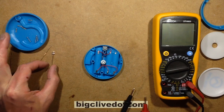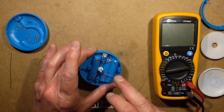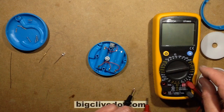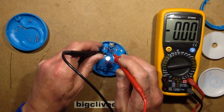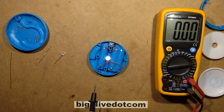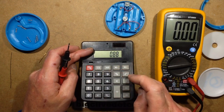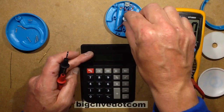I've looked at a suitable replacement resistor and LED. The forward voltage of the LED is about 3 volts. The best approach to measure LED current is to measure the resistor value — the original is 10 ohms — and then measure the voltage across it. Turning it on, the voltage across that resistor is showing 0.88 volts. Using I = V/R, that's 0.88 divided by 10 ohms, showing the LED is passing 88 milliamps, which is quite a lot.